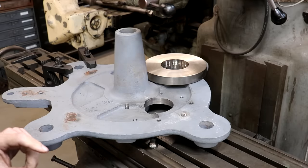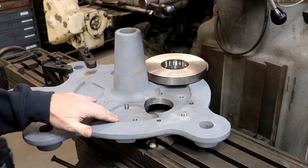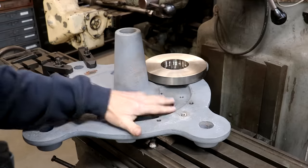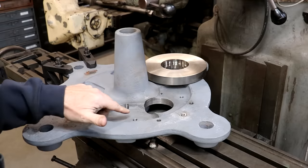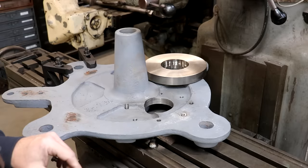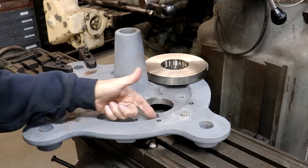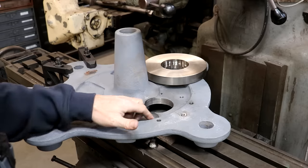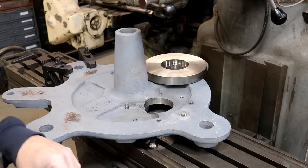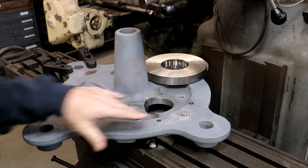It doesn't have to be 100%. If I can get 50% contact in those areas, I think I'm doing good. But right now this is just way too rough. So what I want to do is come in here with the milling machine and basically clean off some area with an end mill so that we can clamp this and get a good measurement to know how much I need to mill out to fit down in here. It's going to be a bit of a challenging project — we've got a lot of curves and not straight lines, so we're just going to have to work around some of this the best we can. Let's get our casting set up over here on the milling machine and we'll see if we can do some milling.